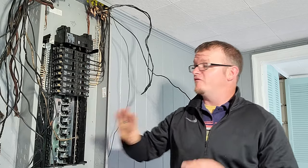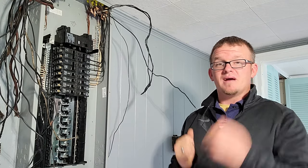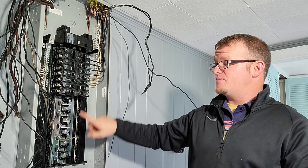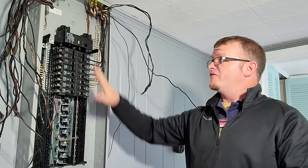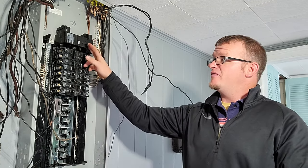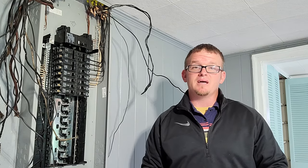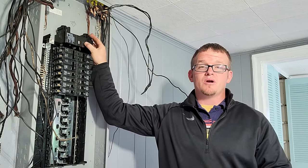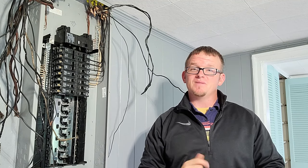I've seen them break and bust and all kinds of bad things that you don't want to happen. So I really encourage you guys, before you ever turn off a main breaker, shoot a picture of the panel — that way you know what breakers were off. You can even tape off the ones that need to stay off when you turn everything back on. Before you hit that main breaker, turn every single breaker off on both sides, then flick your main breaker off, and you're a thousand times less likely to have trouble turning that main breaker back on. Sometimes they just don't turn back on. Just another short tip from the field — I hope you guys have a great day.